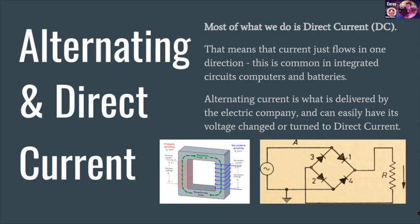And so to go from alternating current in the wall, you just need a bridge rectifier and something to smooth it out. And that's the bare minimum that it takes to go from wall power to your laptop, although you just use the charge brick. Don't try and make your own converters.